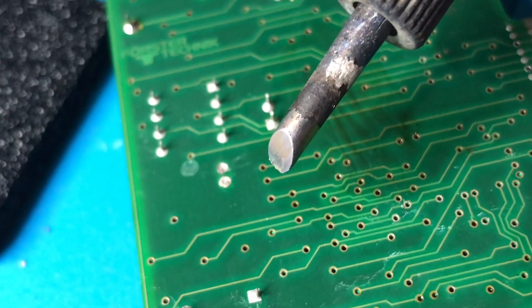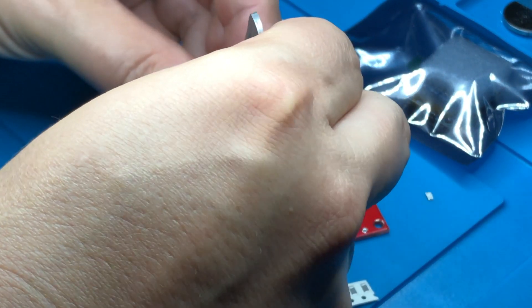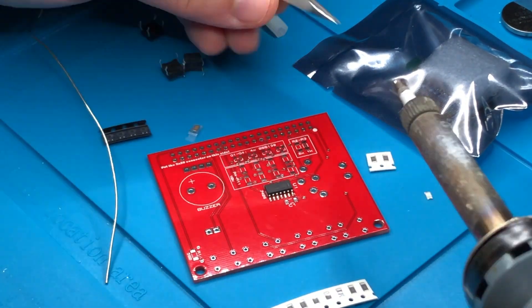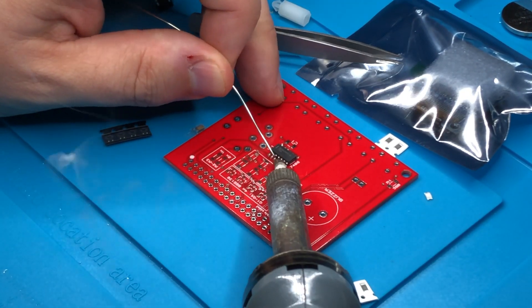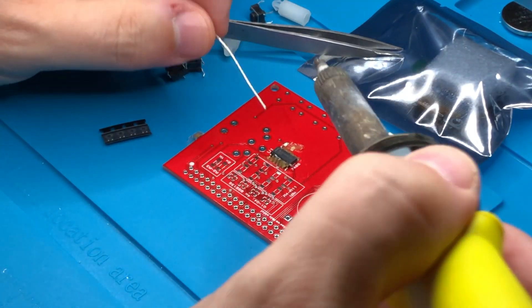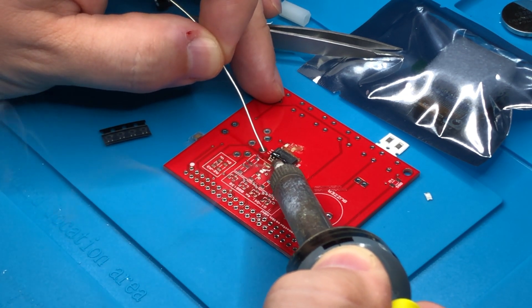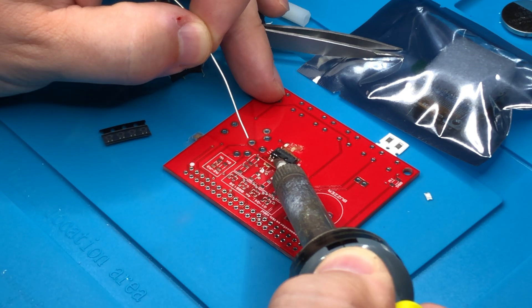I use a tip that is sideways cut with a kind of sharp edge, because I usually get the best results by storing some solder on the tip of the iron and then dispensing it onto the component while using a lot of extra flux on the board. For an IC, I first try to get the corners fixed so it's in a good position, then I put some extra flux and add a lot of solder onto the tip — each leg will just take as much solder as it needs, and the flux will help the solder flow and wet properly.